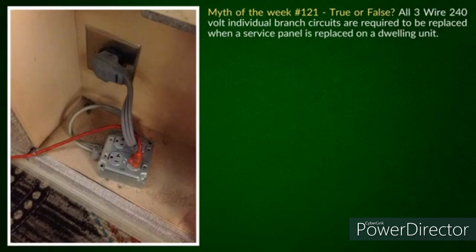We've even seen some jurisdictions say the concrete-encased electrode can be smaller than number 4 too. Oh yeah, sure. And the reason is because they get these people on here that say, oh, you can go smaller. Well, no, you can't. First of all, it's interesting because I submitted to Code Making Panel 5, I think, for Article 250, and I wanted clarification. They said you can go smaller, but they did not reference the material I submitted from previous code making panels that said even the number 6 is considered too small.